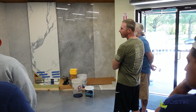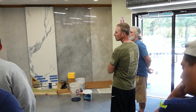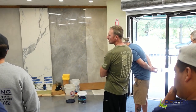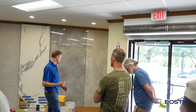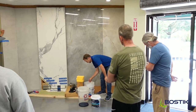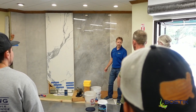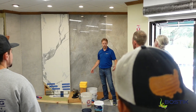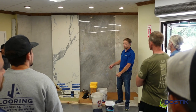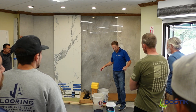You can't wash out the color — whatever color the grout is, that's the color it will be when cured. That's a big reason premix grouts have become so popular in the marketplace: they help alleviate color inconsistency. Contractors deal with homeowners who don't like the color, and with cement grout you can end up lighter in one area and darker in another. This type of product eliminates that problem.